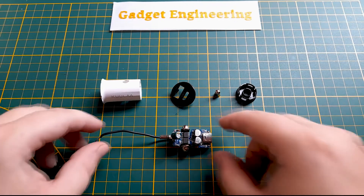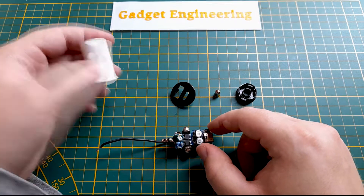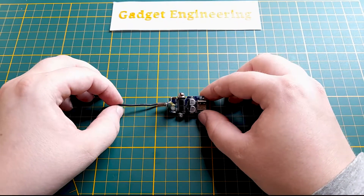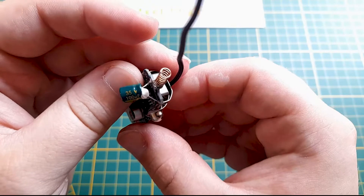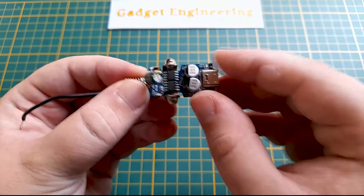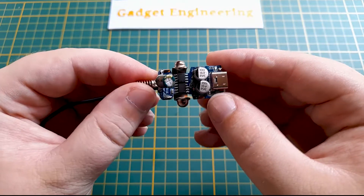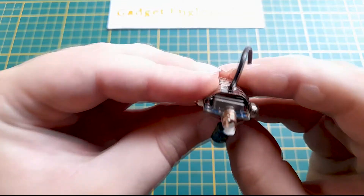After a dose of precise violence being applied to the case — involving two screwdrivers, some pliers, and some additional hands — we have managed to liberate the car charger PCB inside. Moving the remaining parts to the side, we can look at the PCB. On the input we have our standard input capacitor, 100 microfarads at 35 volts. Spring positive, the ground inputs over this little shield. We have two chips leading into two output capacitors of 100 microfarads, giving out the USB-C and USB-A. Two LEDs on the outputs and another one under the USB-A.